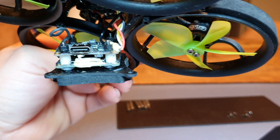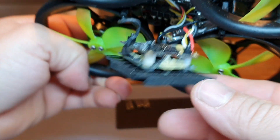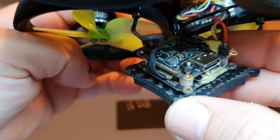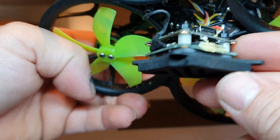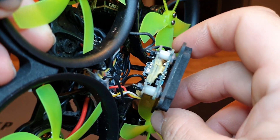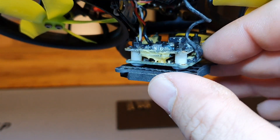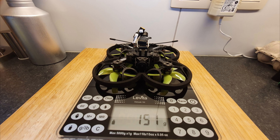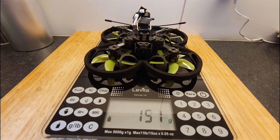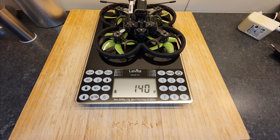Guys, I've got some great news — I just tested everything and it still works! So now we can apply some antenna glue to the ribbon cable connectors and the UFL connector so they stay in place, and then it's ready to be put back inside the drone and fly. While I do that, let's just take a look at the weight I started with and where we ended up. That's a pretty decent weight loss, isn't it?